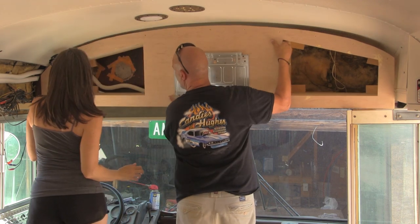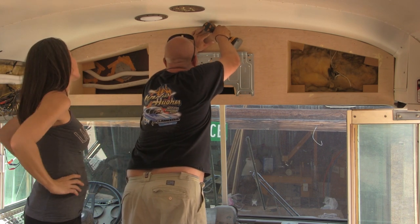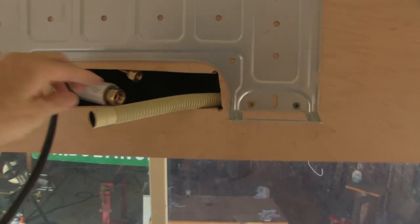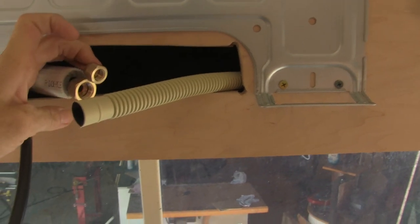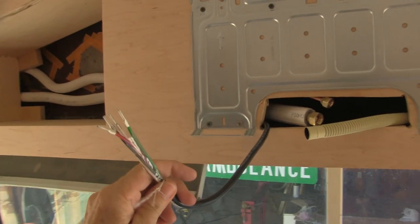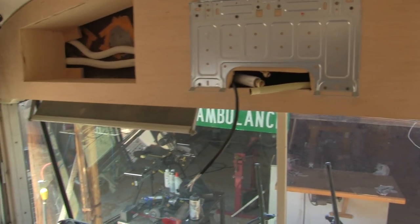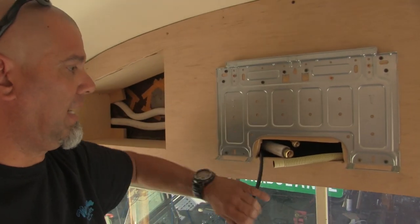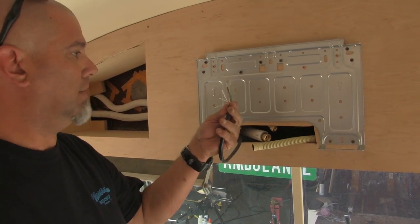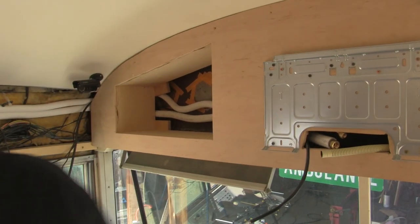They're going to come through on their own. This should go through here and grab the wall. So what are the two copper pipes? Those are the refrigeration lines. This is the drain. And for the electricity — the power for this actually comes from the outside unit, so you're only powering this whole thing in one place for the Pioneer. This is providing the fan motor power and all the electronics back to the back where the compressor is.